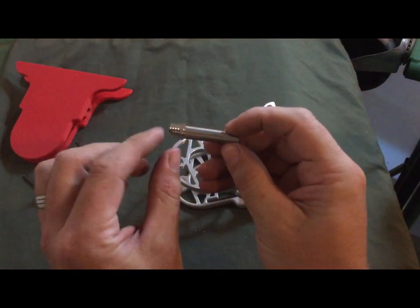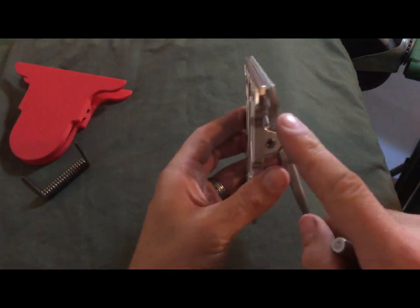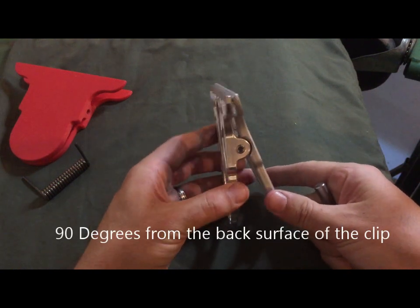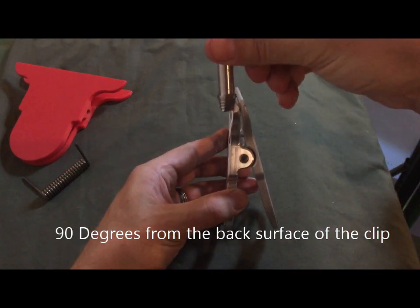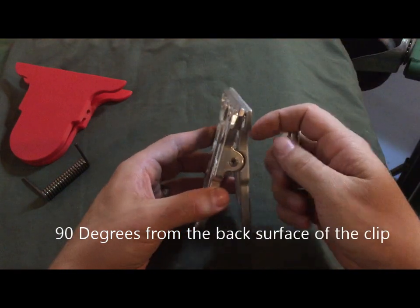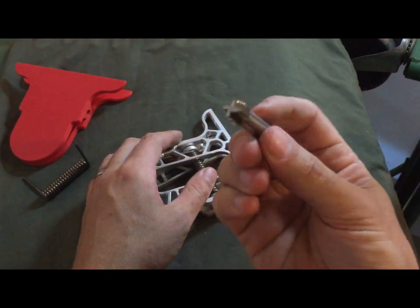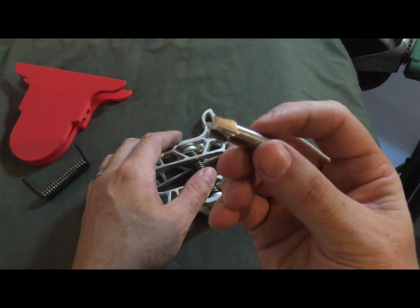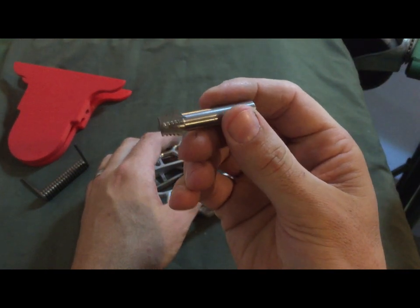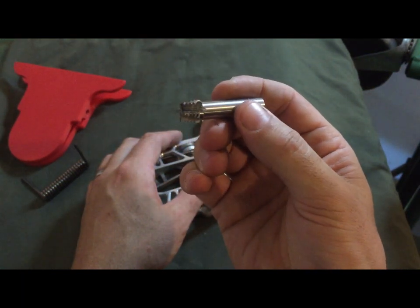It is machined at the exact angle that this face would be while it was sitting at a 90-degree angle on the machine. So mounted up there, this would come along that face and come across it, and machine those teeth out in just one pass. This is a tool steel. I actually took an end mill that had been ruined, and I just took the shank of the end mill and machined this out of it using a carbide cutter.